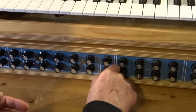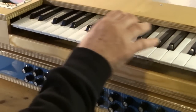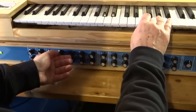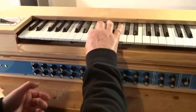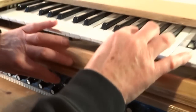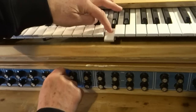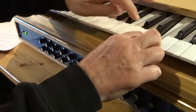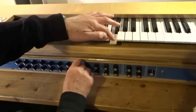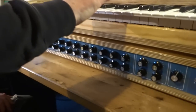And so when I tune the two VCOs together, and let's say I take a square wave signal, and with this button I can change the waveform. I have a square wave now. I can change the pulse width of the square wave. Here I have a ramp. Typical ramp signal sound, sawtooth sound. Here I have a sine. And here I have a triangle sound with its typical sound of a little more harmonics.